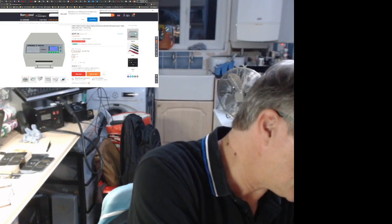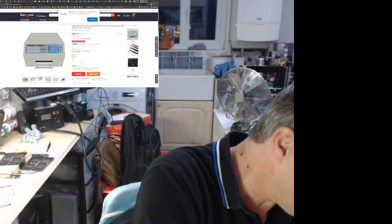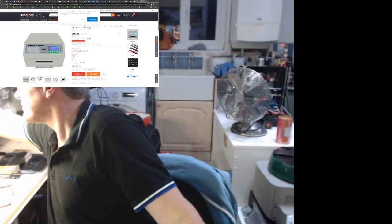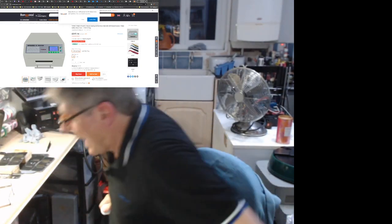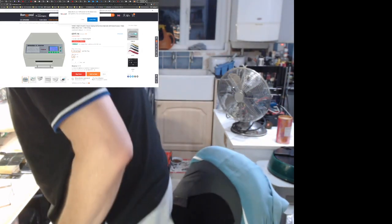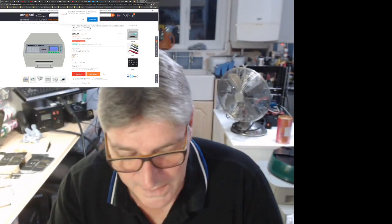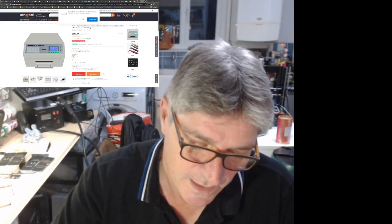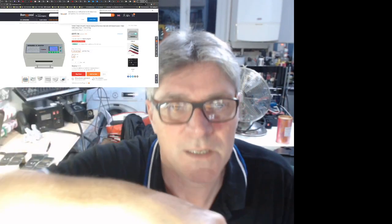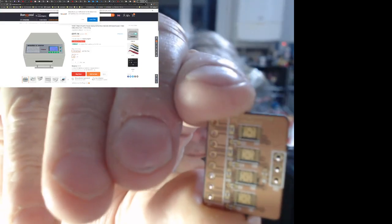And then the other thing that you need to do is you need to probably add on, my advice, there's different ways to do it. I've got two different upgrades. There's one where you can add an extra number of thermocouple places. It already has two, by the way. And two is probably adequate, particularly if you're using the 962 rather than 962A. And you can get these boards from, where did I get mine? I think they're on OSH Park, but I think I got these ones from 1Bitsy.